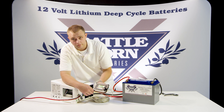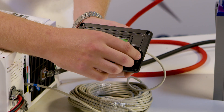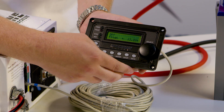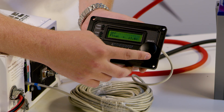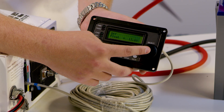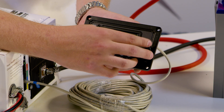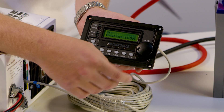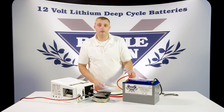At that point the battery is very full — 100 percent. For your float voltage, go ahead and hit the center button again. Anything below 13.6 is acceptable, so we go ahead and put that at 13.6. Hit the center button once more and that's going to be your equalization — basically turn it as low as you can. The lowest we can get it is 14.5, and that'll work just fine for our batteries. That's it — thank you for watching and have a great rest of your day.